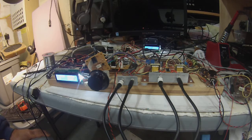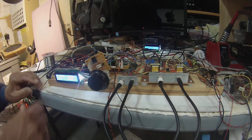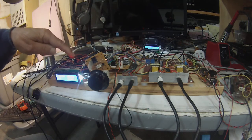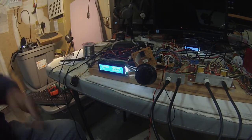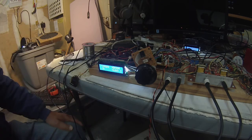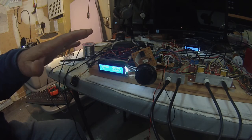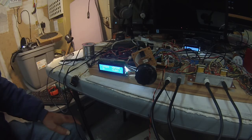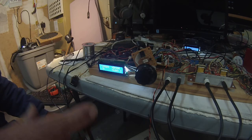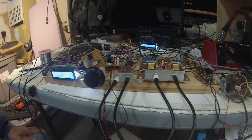Now, downstream, one interesting aspect of this configuration would be that you could have a pretty sophisticated display used right here with the Teensy to display spectrum, like a color TFT, a big screen, and you take the workload off of the Teensy to supply just the LO, because the Teensy 4.0 runs at 600 megahertz, and you only need something that's 16 megahertz clock speed to generate the frequencies that you would need for the phased LO to drive the RADIG board.